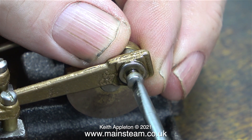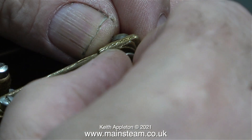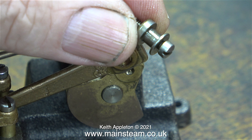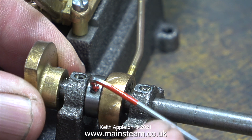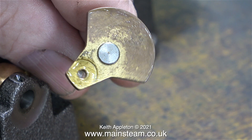I need to remove the crankshaft to have a look at it. In this clip I'm removing the slot-headed bolt that holds the connecting rod to the crank web. I quite like the design of the separate sleeve — as the connecting rod wears you can just make a slightly larger sleeve to compensate. A single grub screw holds the eccentric sheave to the crankshaft, and once I slacken this off the crankshaft slides out.